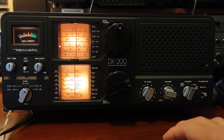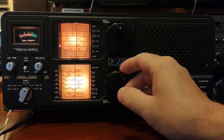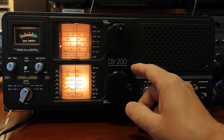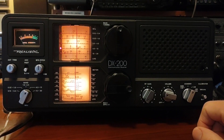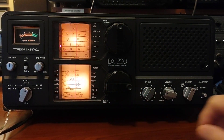We're going to start out with doing the main tuning. When you're going to only use the main tuning, you're going to set this band spread right at the set mark — that's going to be your default setting. Once we're calibrated, you're going to leave the band spread alone and just use the main tuning. The BFO pitch should be in the center position.